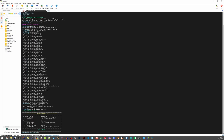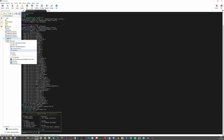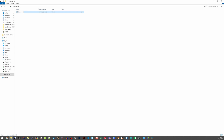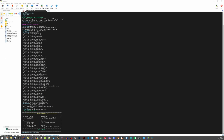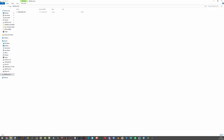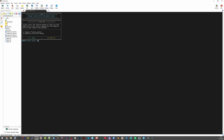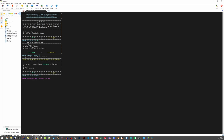Go back and save it — it will compile everything that needs to be sent to the mainboard. When compiled, you can see it has created a hex file in the folder called 'out'. This is in the Klipper main folder, accessible via the left column — there it is: klipper.bin. Depending on your mainboard it might be a different file extension. Put that on an SD card and rename it firmware.bin — this may or may not still be necessary depending on your board, it's a habit from Marlin days. Add the SD card to your mainboard, power it up, and wait a minute. To check if it worked, open the SD card again — if successful, the extension will have changed to .cur. Alternatively, you can flash directly from the Pi to the mainboard via USB from the Advanced menu, but not all boards support this, so my advice is just do the SD card route.